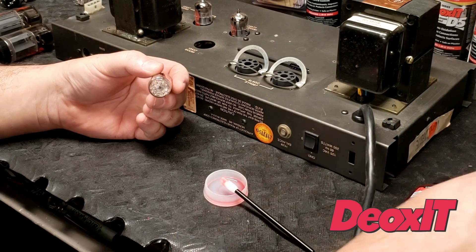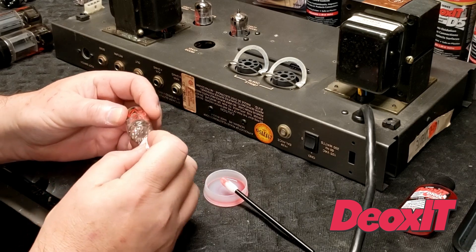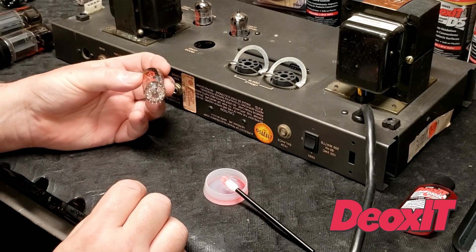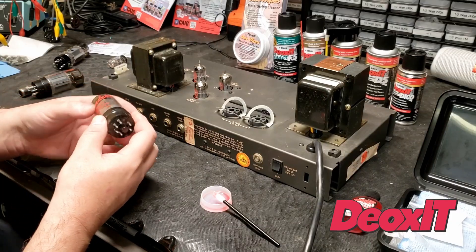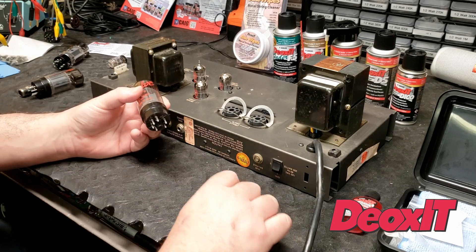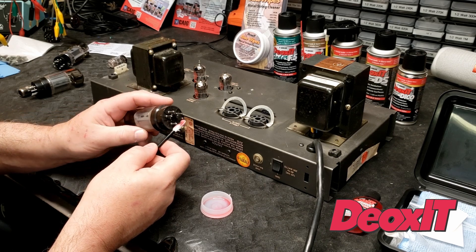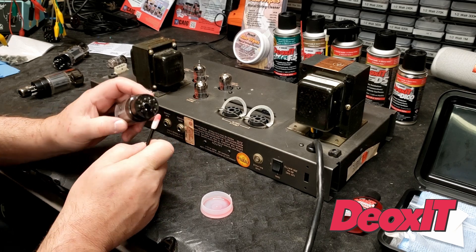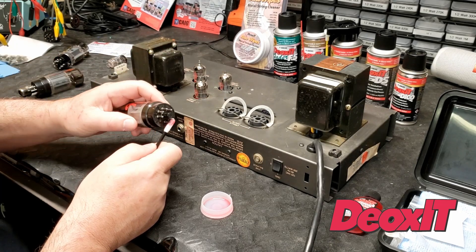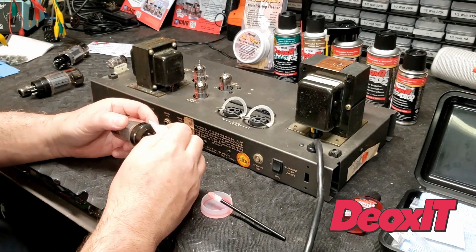The kit comes with these wipes, which are really nice because you can remove the excess and you won't have any drips. Get it right inside where you need it and clean all the facets, all the different sides of the pins. This one's ready to go back into a socket. It's a little easier to see the cleaning on the large tube sockets — the octal tube sockets for the octal pin — the power tubes. So I'm going to go ahead and also clean the pins on this one. Mostly on the outside, it's easier to get to because you have the plastic locator pin in the center. There's a little edge which is the index pin, which will line up with the index keyhole in the socket. We've got the chemical on there, so those are getting cleaned. We're going to let it do its cleaning for a second, and then we're going to wipe it off.